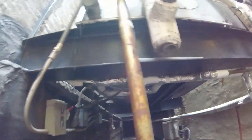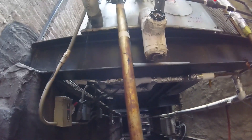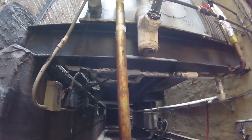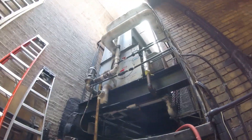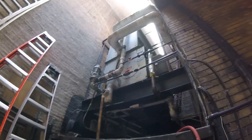Right over here is the makeup water. I opened up the bypass — this is the overflow — and I opened it up until water started overflowing the tower. I know for a fact that the tower is cold. Went back to the sensor and we dropped 21 degrees in a matter of minutes. Right now we have a 79-degree inlet temperature.